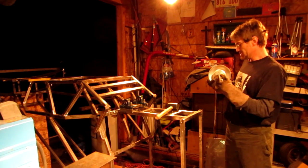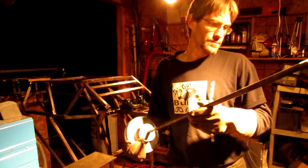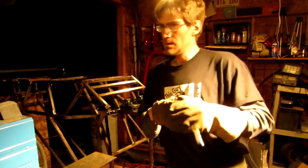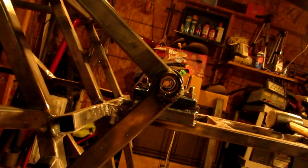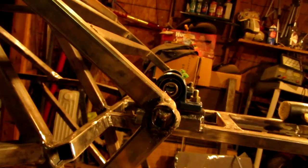Got some scratches from welding splatter on the axle — nothing that a little bit of sandpaper can't take care of. Now as long as I don't mess up my pillow block bearings when I tighten those down, I have a feeling I'm going to have to readjust those two pillow block bearings, which is going to offset this by about an eighth of an inch, which means I'll most likely need to get a chain tensioner on this. That's no big deal though.